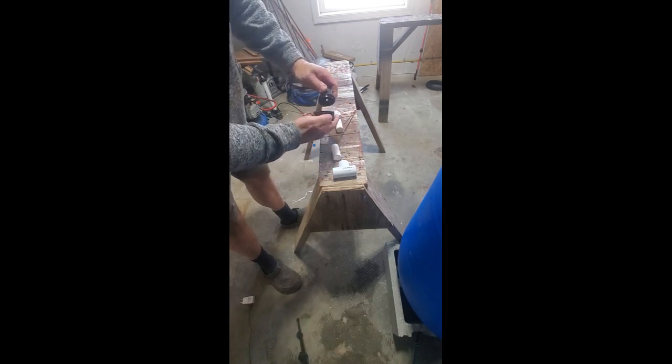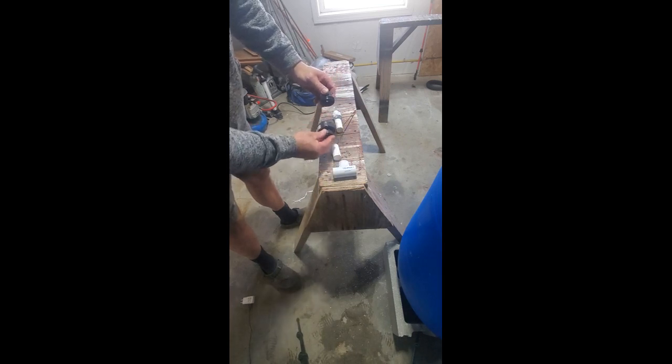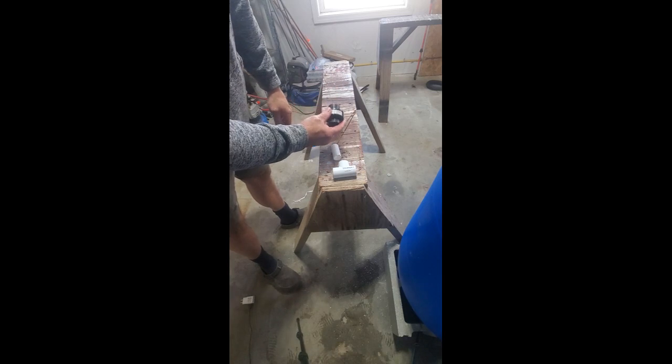So how I'm going to put these on, this is kind of important, is you want your threaded female end on the bottom, so towards the T. So when you come up into your pipe, it's just a simple tighten, just like that. And that's how you'll take it apart when you winterize. If you're in a climate where you freeze, you can just pull your pipe assembly off, stick it in the basement or the garage, place warm, and let everything just go for the winter. Simply hook each connection back up the following spring when you're ready to collect water.